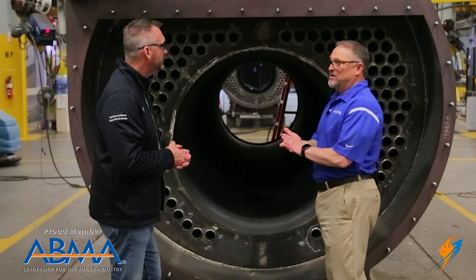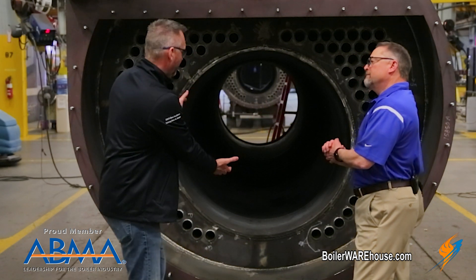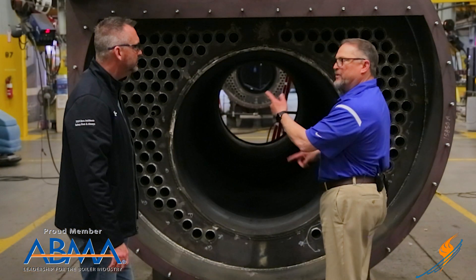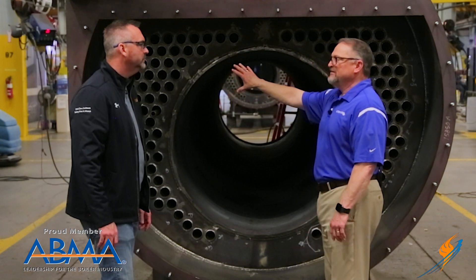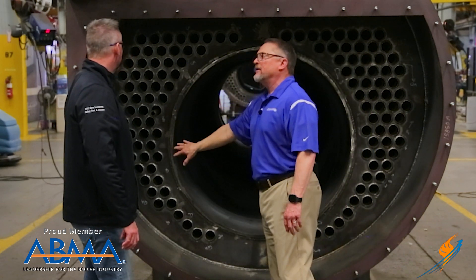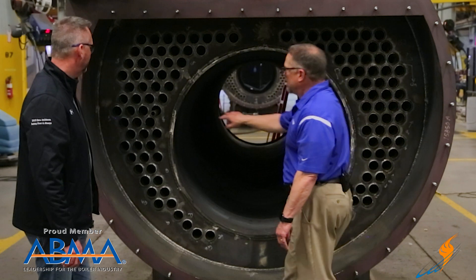This is a two-pass boiler. A quick question people might want to know: why is the Morrison tube at the bottom and not in the middle? On a two-pass boiler, you want that lower position furnace so the hot source at the bottom creates natural circulation inside the boiler. That prevents stratification — hot pockets — in the water, which can cause problems with the tube or tube sheet area. Many failures on certain products occur in that lower, hottest section when circulation isn't adequate.